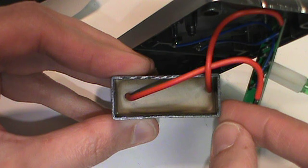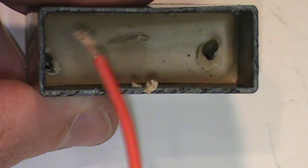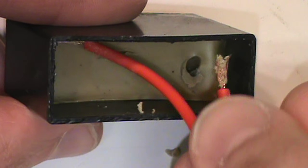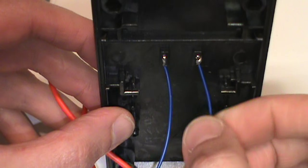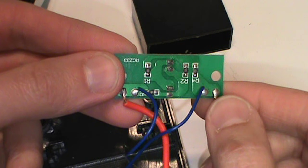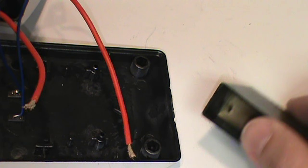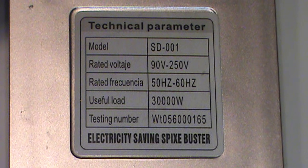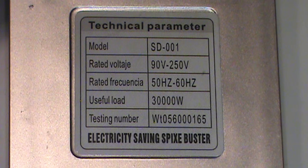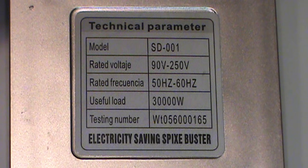I'm guessing the only thing in there is some glue — it may look like a capacitor but it's non-functional. That's actually just wax in there. I gave the wires a little tug and they pulled right out without much effort, and these were definitely never soldered to anything — they just put the wires in there and filled it up with wax. Look at how incredibly thin the wires are going from the prongs to the little circuit board, which simply contains some dropping resistors for the LEDs. So that's all this does: just lights up some LEDs. This fake capacitor is just a block of wax. I did initially think it might contain a MOV — a metal oxide varistor — which would give it some minimal effect as a spikes buster, but clearly if they were going to lie about its main claimed benefit, nothing was stopping them from lying about its secondary benefit as well.